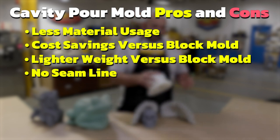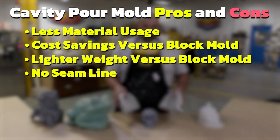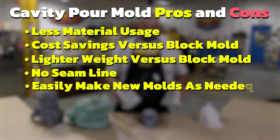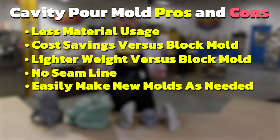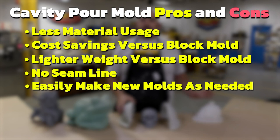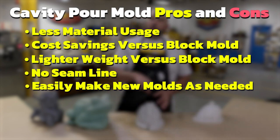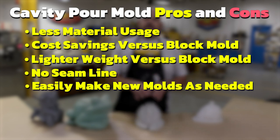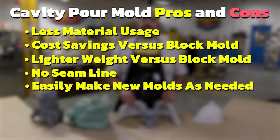Now, one really nice thing about cavity pour molds is once you have the support shell and your rubber mold burns out from casting hundreds and hundreds and hundreds of castings into it, it will eventually burn out. You can take the support shell off that mold, put it around your model, and now pour a new glove mold off of that model, which makes it really convenient for production style molds.